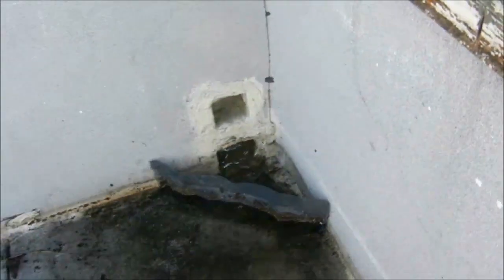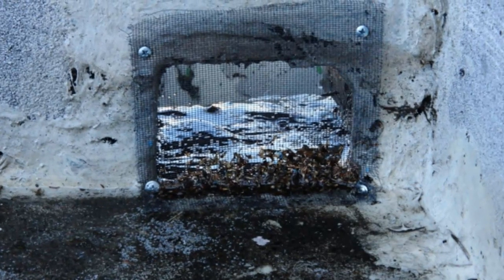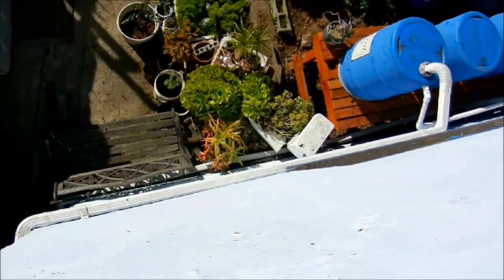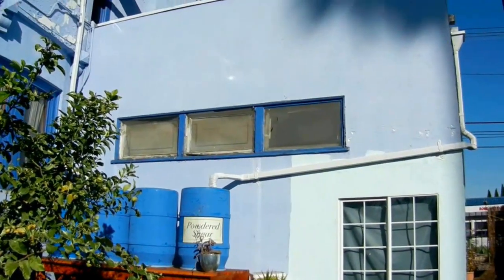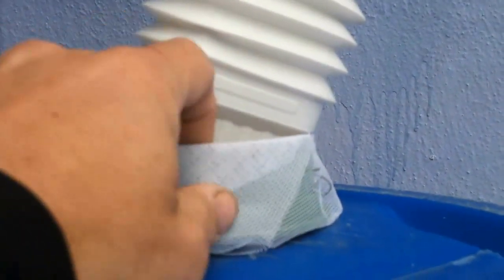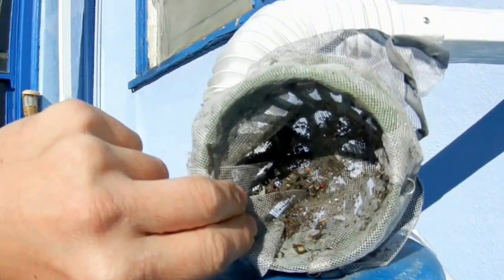At the entrance to the flat roof downspout, I put up a piece of old door screen. This is actually the second generation screen — originally I put the screen right up against the hole and it clogged up, causing some minor flooding. The new screen has worked out really beautifully, even in the face of some pretty big storms. The water catchment comes down the downspouts, which I reconfigured to gravity feed into four-inch filter baskets. I picked those up at Home Depot for about five dollars, cut up some pressing pad for about three dollars, and stapled and pulled the pressing pad taut over the baskets with rubber bands. These work really well to keep out debris and bugs and just need to be emptied out after storms.